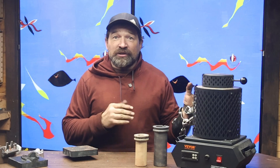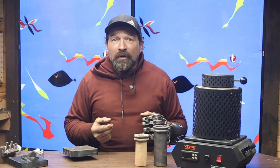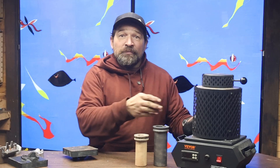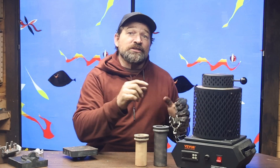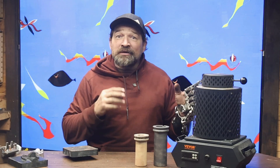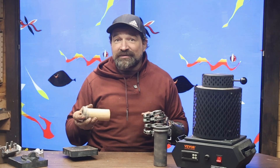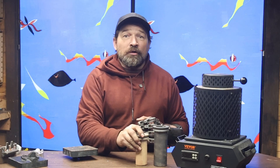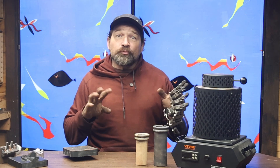How is my experience with the 1,350-watt electric melting furnace so far? I've done right at 20 cycles with this setup. With what I've been doing, it's performing very well. Surprisingly, it doesn't leak a bunch of heat. The only part that does get hot is the flip-up lid. The temperature control of the melter is pretty basic — there isn't any ramp and hold programming available on this unit. To temper your crucible for its first use, or when warming everything up at the beginning of your melting and casting session, you'll need to do your set and hold temperatures manually. But once you've burned all the moisture out of the crucible and got it up to working temperature, it seems to hold the programmed temperature pretty reliably.